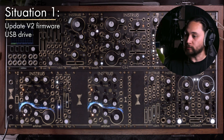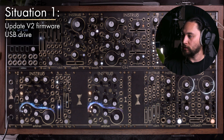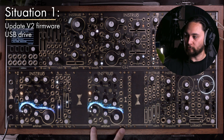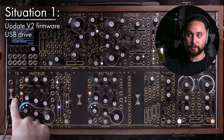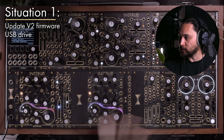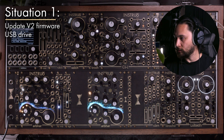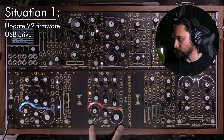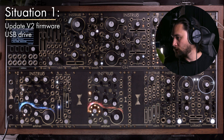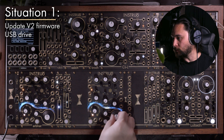To apply the update, connect the USB drive to the Arbor and power cycle. On this first power cycle, it's going to look for anything in that underscore updater folder and will apply the update automatically. The startup sequence might be slightly slower than typical. It's entered its red screen, it should show the onset modes — and there we go, that's us running.